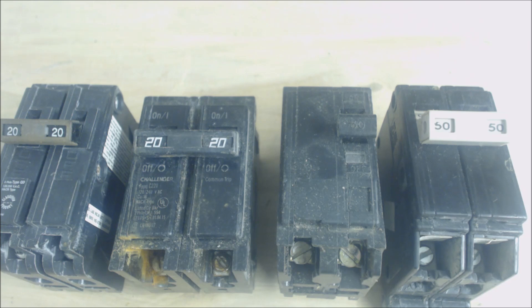So if you see that, or if you know your breaker box is older than 1995 and your breaker keeps popping due to the air conditioner running, first of all immediately get that looked at for safety's sake. But secondly, after the electrician replaces the breaker, take a steady amp draw reading — as long as you're qualified to do so safely.